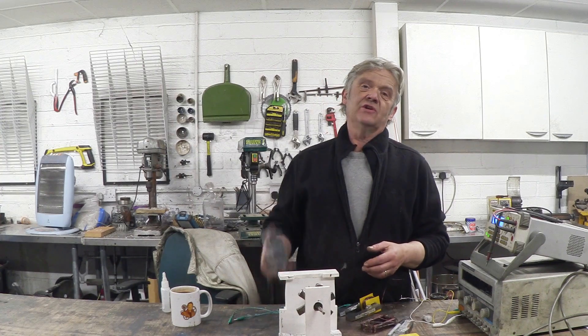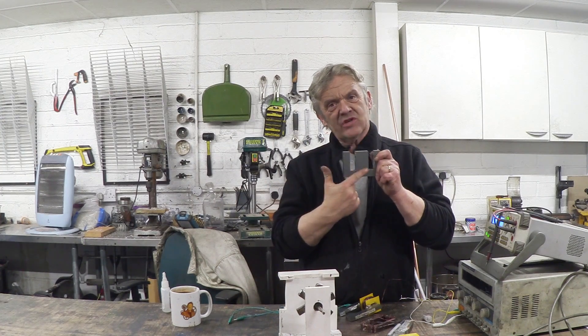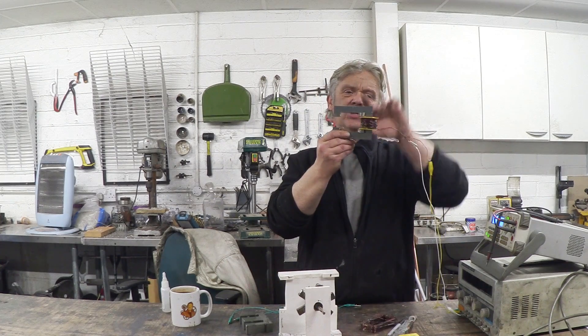In order to make this next iteration, what I did was take a microwave oven transformer, chop out the central E, chop off one of the legs lower, and then chop off one of the legs and put it together to make this C shape. So this is a bit of C-shape lamination.